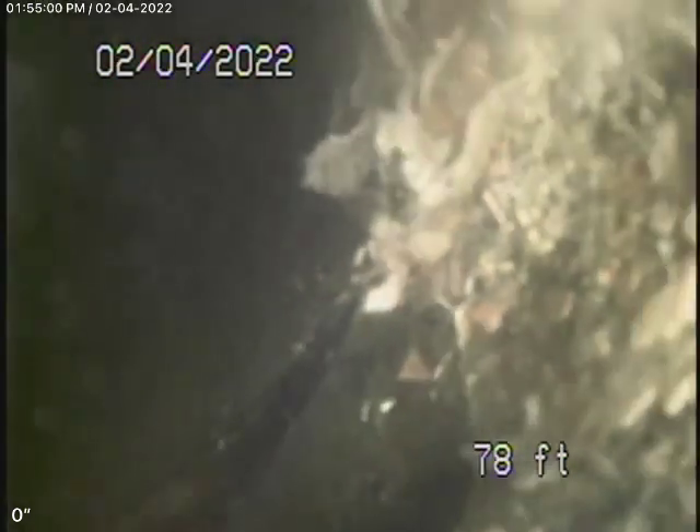That was confirmed. We're running the camera from the toilet here. We're able to get a small camera into the line. The big camera wouldn't make the turns in the beginning — a lot of turns. But this is a pretty good camera, about a 200-foot camera. Nevertheless, we're in about 80 feet where we can't push the camera any further. Bear in mind we've gone through a lot of turns and we're all the way outside to the property. It's very possible there could be roots over here blocking it because we're at the 4x6 connection.